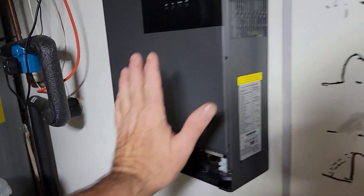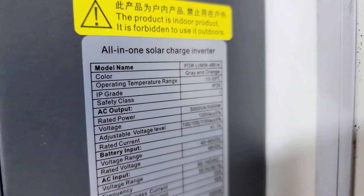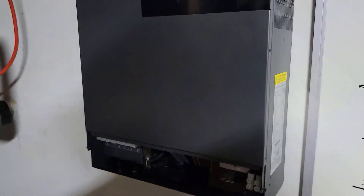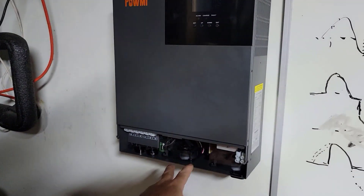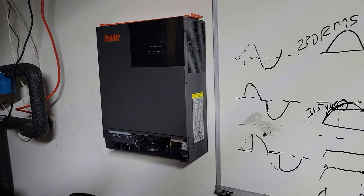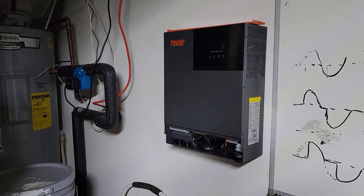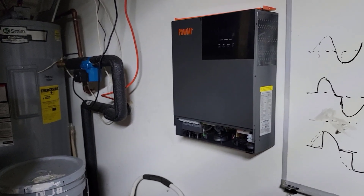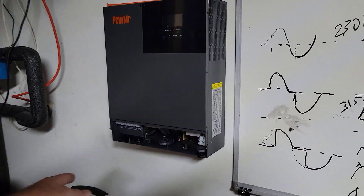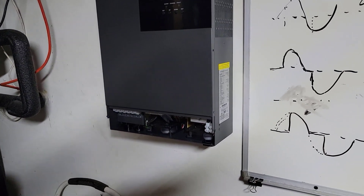It's supposed to be 5,000 watts max. I mean it's physically not all that big of a system, but that is the max rating on it. The cool thing about this one is it's high voltage solar input, so I'm going to keep my solar array the way it is at 330 volts DC. That way I don't have to have beefy heavy-duty wiring for the 5,000 watts worth of solar — I can keep it 12 gauge and just run it in here.